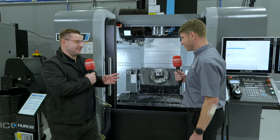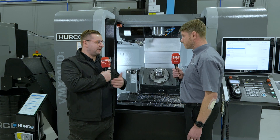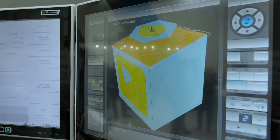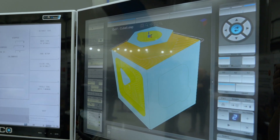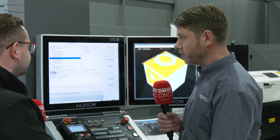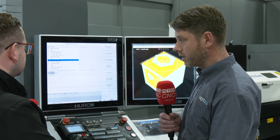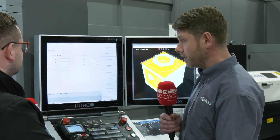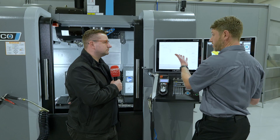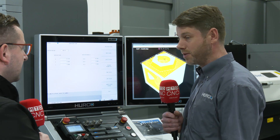I want to get on to training in a minute, but how easy are these machines to learn? Say I've been a machinist for five years and run all different brands — how quickly could I pick this programming up? Essentially you're programming using canned cycles, so if you're using Heidenhain or anything else that uses canned cycles, picking ours up is just a piece of cake. And then on the conversational side of programming, you simply press enter to go into the block, and essentially that's your transform plane for your five axis work — a datum shift and a rotation of your tool angle. That's an extra block to make it a five axis positional move. Simple as that.